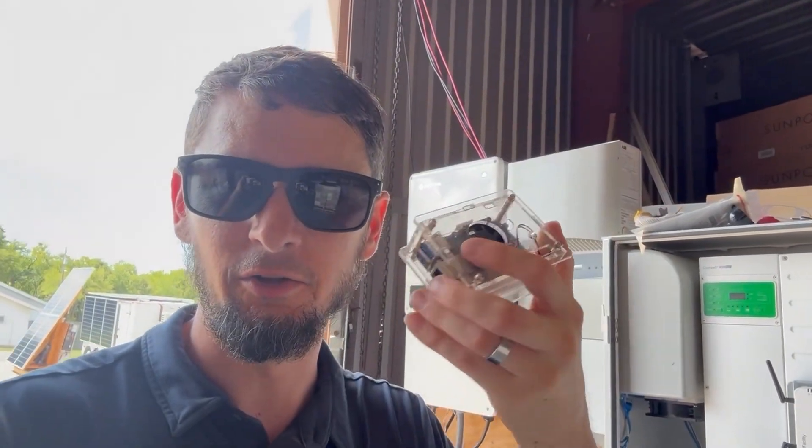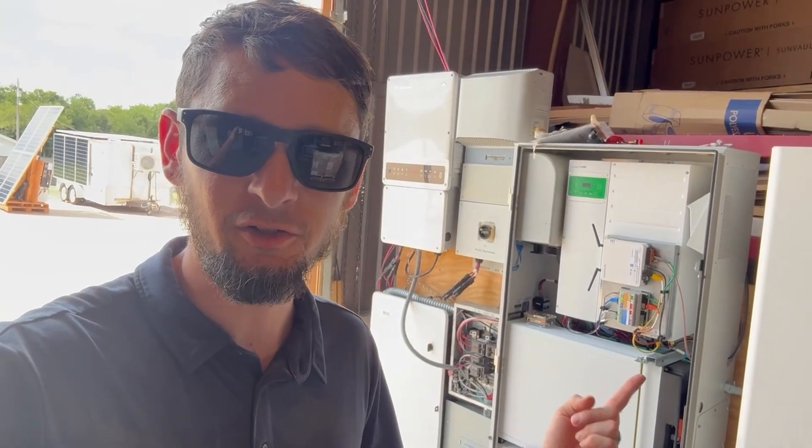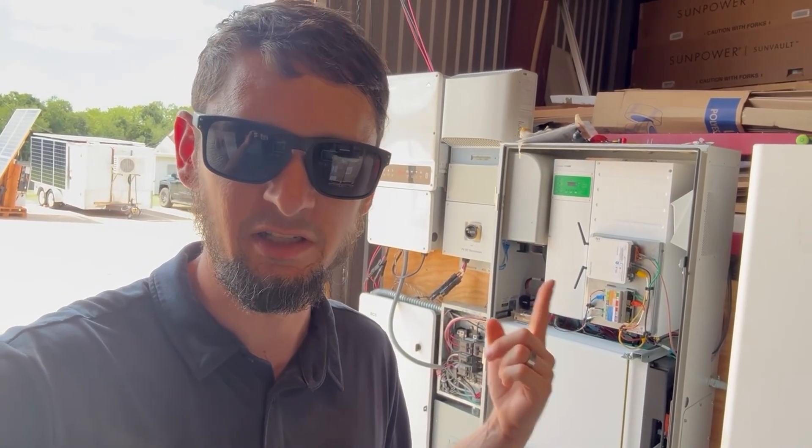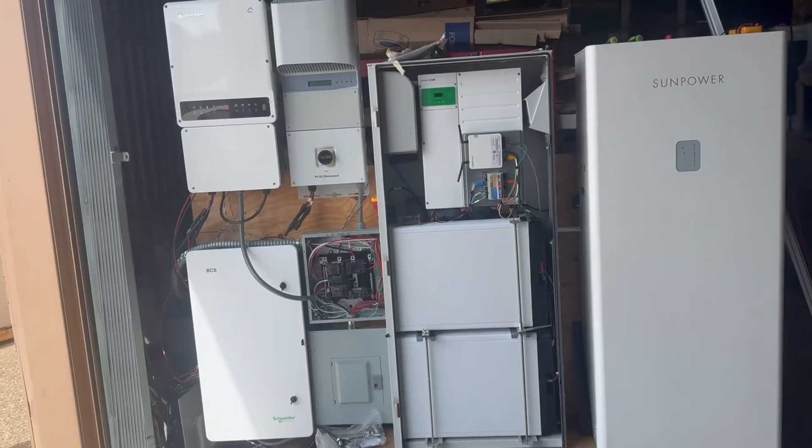The key — and I'll show you how — is this little miniature computer to fix it all. We've got a 6.8 kilowatt Schneider low-frequency split-phase hybrid inverter, the Insight Gateway which controls inverter configuration and monitoring, the SunPower MIO (multi-input output) which controls the cooling fan and keep-alive to the batteries, and down below three 6.5 kilowatt-hour SunPower lithium iron phosphate batteries — giving us 19.5 kilowatt-hours of capacity in this cabinet.